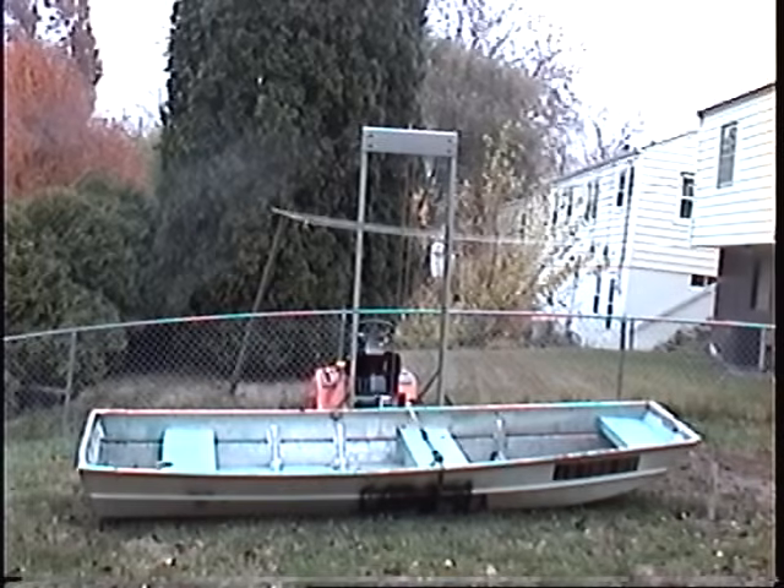Hello, I've done some updates to my forklift. The first video is on YouTube — this is an update. What I did was change to a heavier frame. There used to be a 13-horsepower internal combustion engine. That's been switched over to a 36-volt, 2-horsepower electric motor.